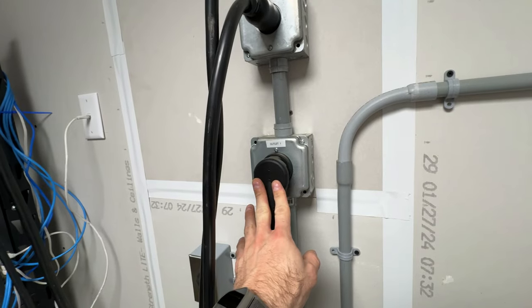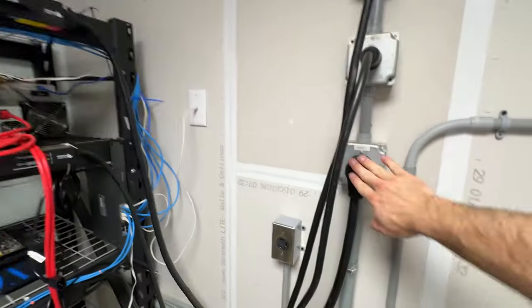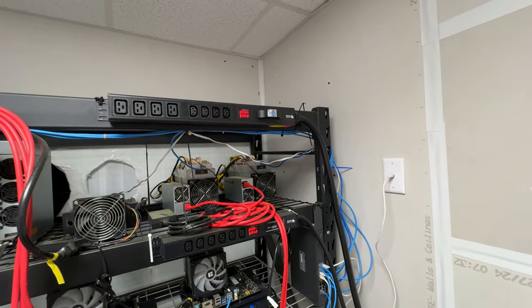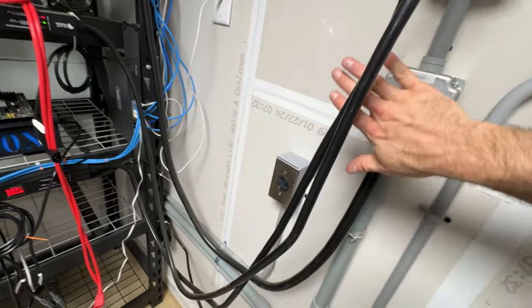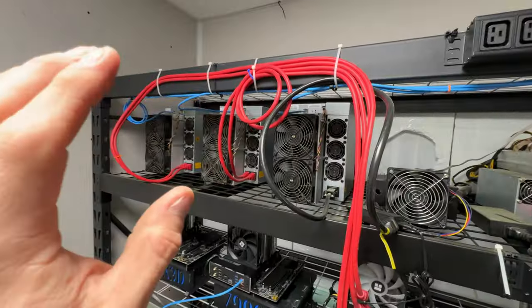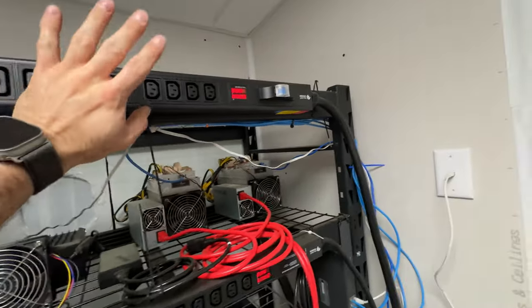It's just at that upper limit I'm a little uncertain about it. I don't think there are separate layers of containment and safety, so I'm not going to nix it entirely. But I absolutely would not recommend a 50 amp PDU unless Tripplite makes one — and if Tripplite makes one it's probably like four or five hundred dollars. I wouldn't recommend running a 50 amp outlet for single-phase residential application. Stick to the 30 amps. What I'm going to do is leave it in place but limit it to only these three miners — nothing else.